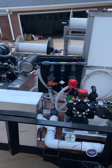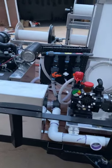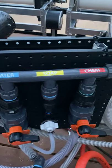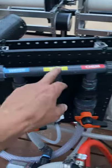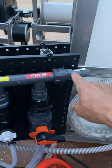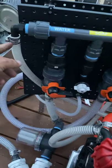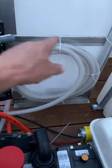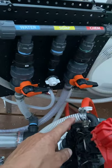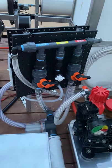The best thing about these gas roof pumps is the proportioner system — the way I've got them, this is top notch. I've got them labeled — had these made up so when guys get them they know exactly what everything is. This is your main outlet, comes around and goes right to your gas roof pump. This is your bypass — that's 25 feet of coiled-up hose — it runs from here through that hose and comes back, bypasses through the hose so you don't burn your pump up.